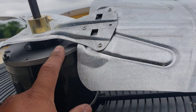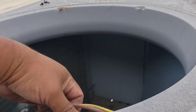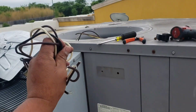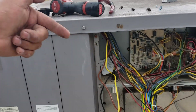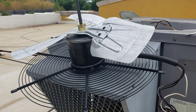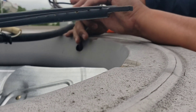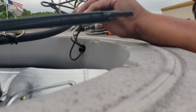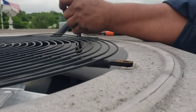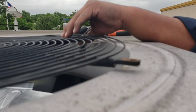I can route this through here. In order for us to get some air out of here, what I did was I left the old motor wires in place - they're right here - so all we're going to do is tape the new wires to them, pull them through, and hopefully they make it all the way out. If not, we'll have to disassemble and feed them properly. Boom - got it!